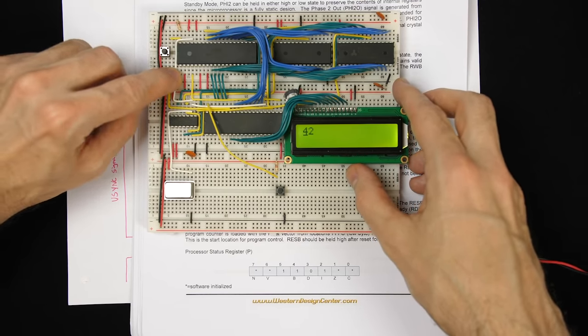It should be pretty straightforward to implement and it'll work well enough. We've got the READY pin, currently tied high, but bringing it low halts the CPU. However, the CPU may still be putting stuff out on the address bus or data bus when halted. So we need to not only halt the CPU — we also need to tell it to stop doing anything with the bus. There's another pin for that: the bus enable pin on pin 36, also currently tied high. If we bring bus enable low in addition to halting the CPU, it puts the bus into a high-impedance state — the CPU won't put anything on the address bus, data bus, or the read/write pin — allowing the video card to take complete control of the bus.